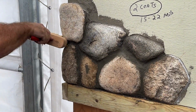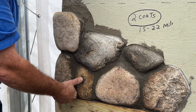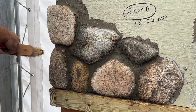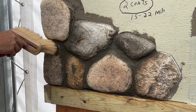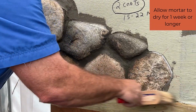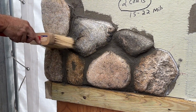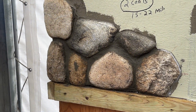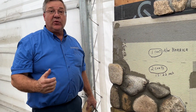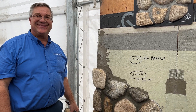Please don't get worried about this little bit of pointing mortar that's on the stone or any that spilled. Later, when we clean that, it will clean right up. The most important thing is to get this compressed and brushed. In about a week or longer — you could wait two or three weeks, but wait at least a week — for this to dry enough that we can use the cleaner and clean the surface. This is David at StoneYard.com. We'll see you next time.